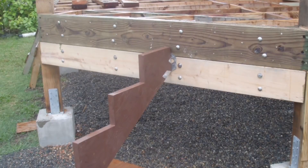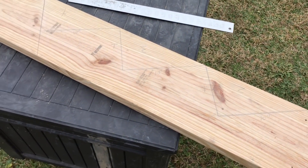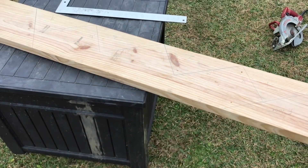And then the next step will be on the top of the platform that you'd be going up to. This is exactly what I mean — my last step would end there and there would be another 7-inch rise, and that would put us perfect on the top of the deck we were building up to. So 7, 14, 21 — and we're going to cut it across. I'm going to cut this out and then show you what I'm talking about.